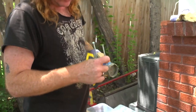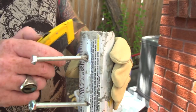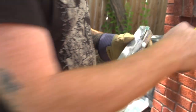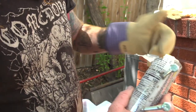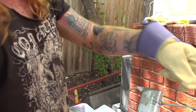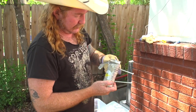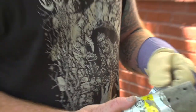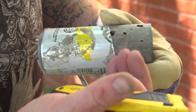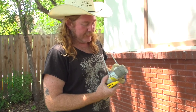Next step — peel the cans off. You're gonna want a pair of gloves so you don't cut yourself. Go ahead and remove the tape first as much as you can. If it's sunk in a little bit, just take your time when you cut. Kind of twist and pull down, rotate around — try to get it off in one big pull if you can, but just get as much as possible. I'm already noticing we got some honeycombs right here, which isn't great — maybe I didn't vibrate as much as I should have.